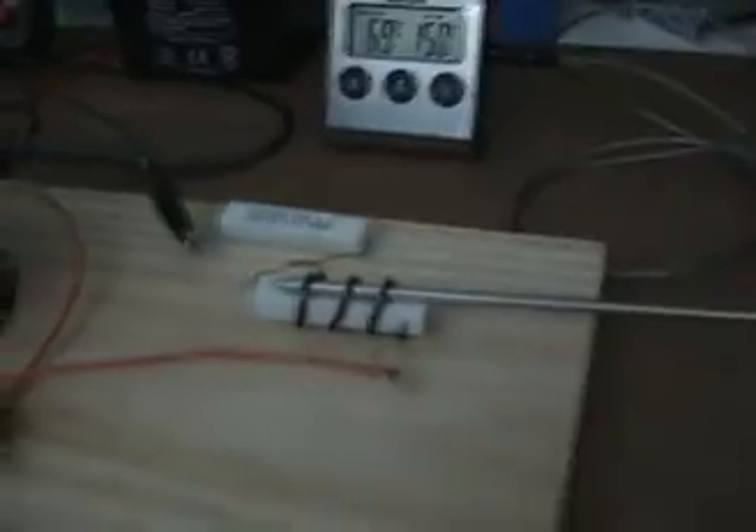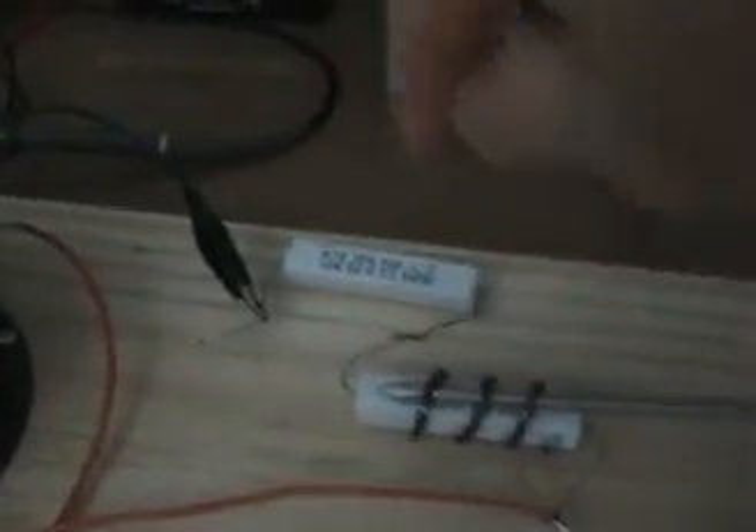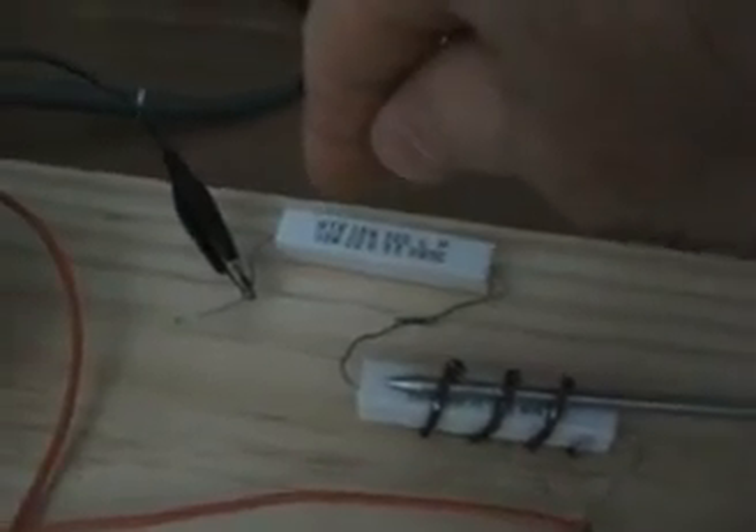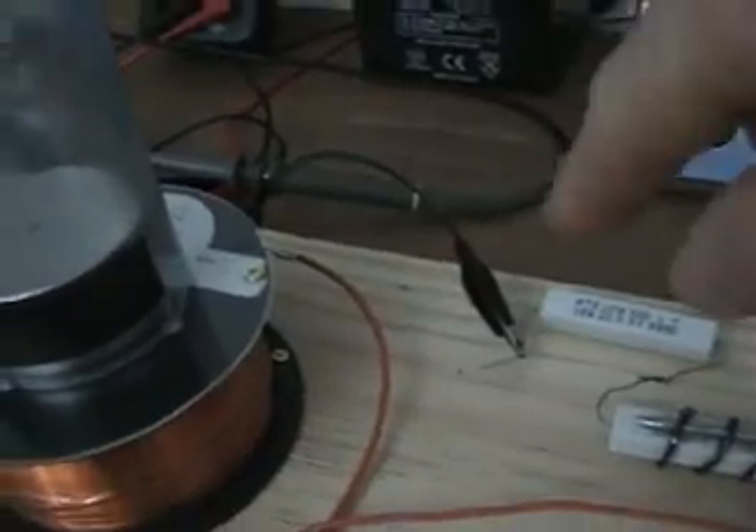The interesting thing I've also done here is I've put two 22-ohm resistors — these are wire wound resistors, 5% accuracy, 22 ohms each, in series. The recirculating diodes are back there, so when I flip that switch the back EMF goes through this direction, through these two 22-ohm resistors, and then back into the coil positive side again to get recycled.